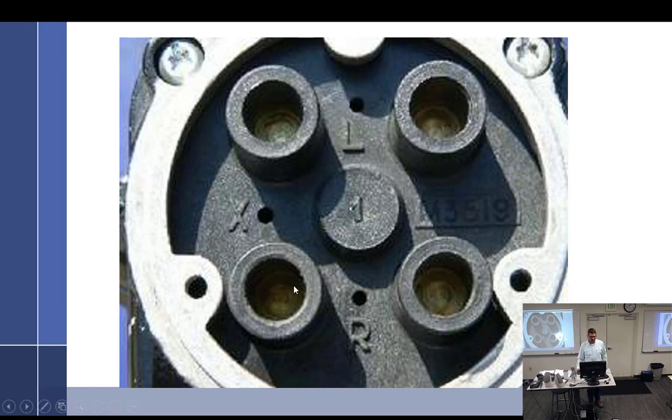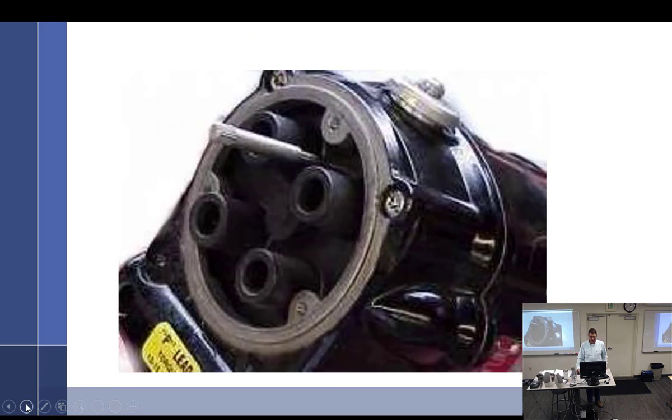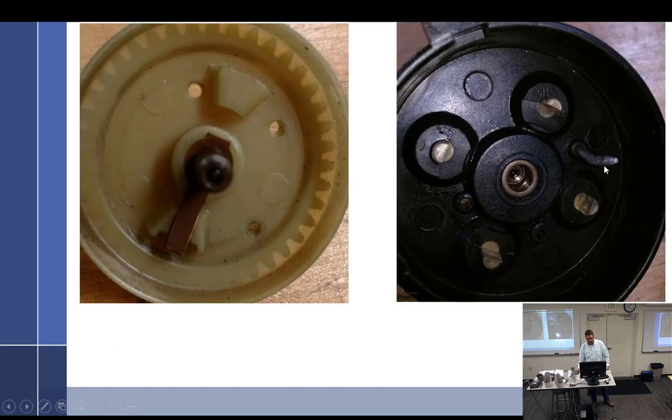Laser ignition. Okay. Put the pin in. Make sure you're very careful with the pin. I do it on a table. Set the magneto down. I rotate it backwards and kind of feed the pin in and out, because the finger that points to the cylinder that's going to fire is in there. If you leave the pin in there, it's going to come around and bend it over like that, because this is what's going around inside there.